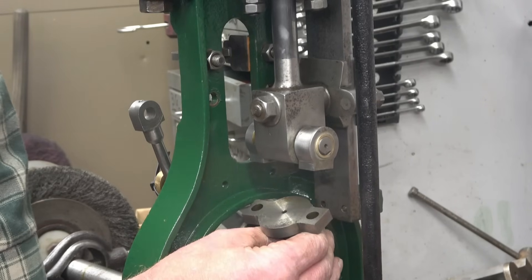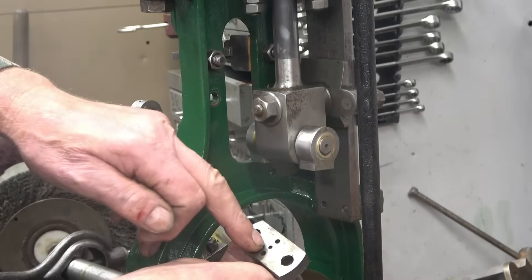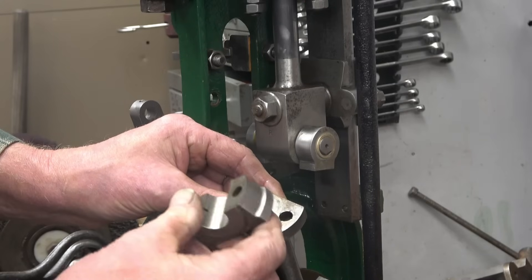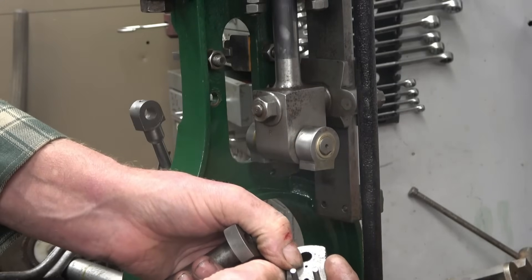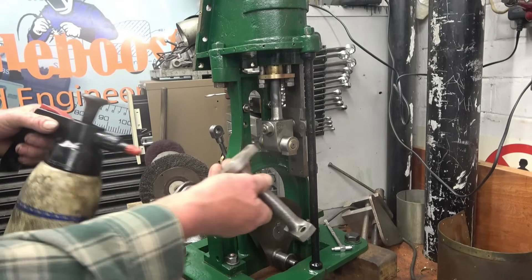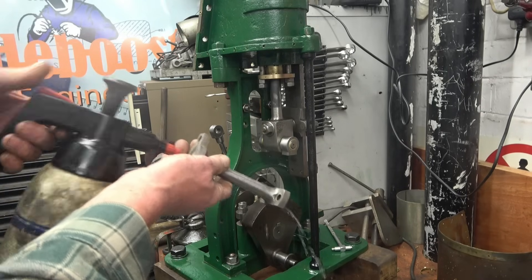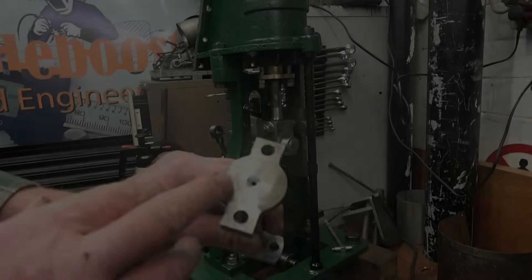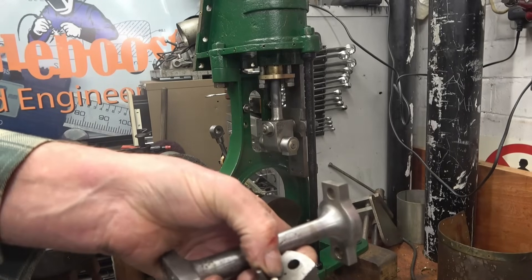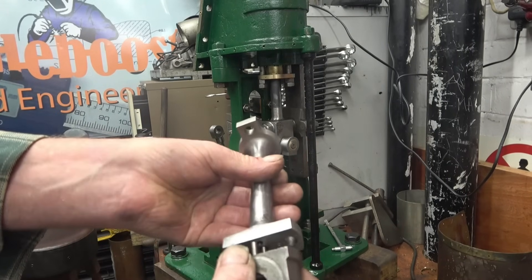This engine's strange because I don't think it's been run much but everything's been bastardised and repaired on it. There are two dowel holes in the bottom and two dowel holes in the top bearing cap, and that's the oil hole to lubricate the big end there, which isn't very big. I put a bigger countersink in there to collect a bit more oil. That's the oil hole in the bottom which corresponds with the little oil hole and that's what feeds the big end — that's the way it's been designed and built.